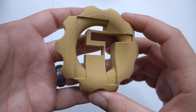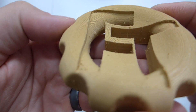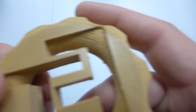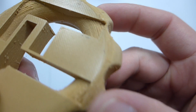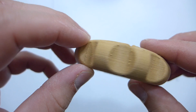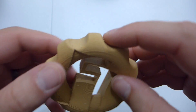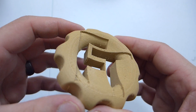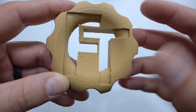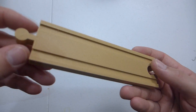The first print I did here was my MakerCoin on the Anycubic i3 Mega. You can see there is some pimpling going on there. The bottom stuck really well to the Ultra Base and it did really, really good over the supports. It has a nice rounded slope on all of these, so the cooling was adequate and it held its form well. Layers adhered to each other well, there were no under-extruded parts anywhere, and it had very minimal stringing — just the pimples. I pretty much got rid of all the stringing, which was nice to see.